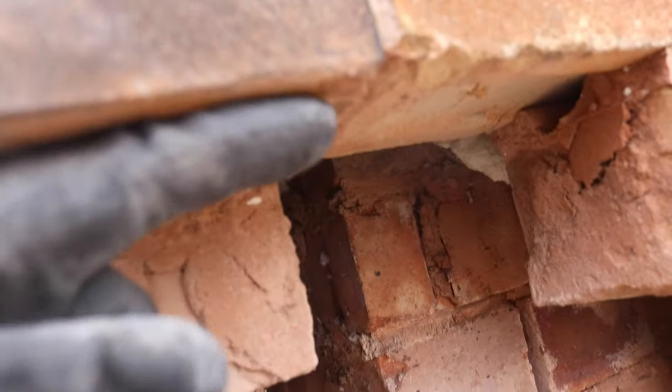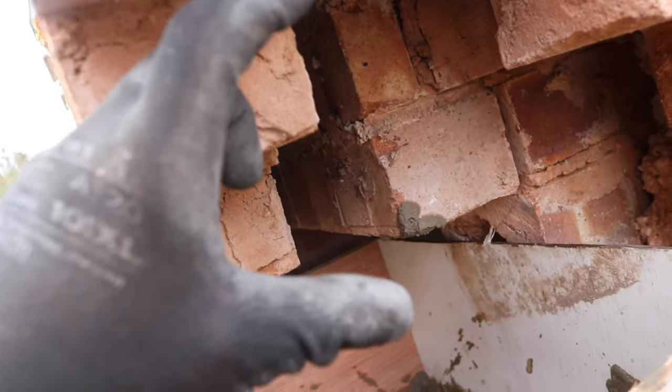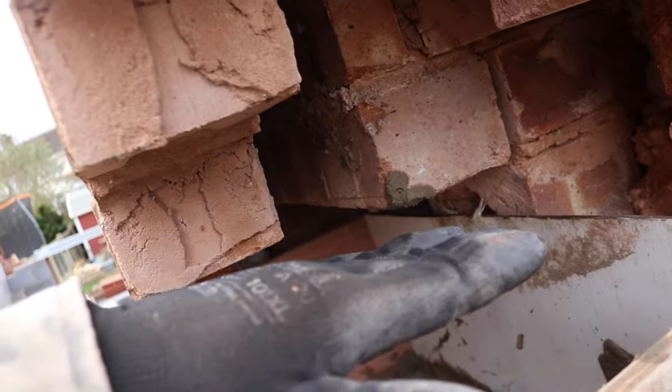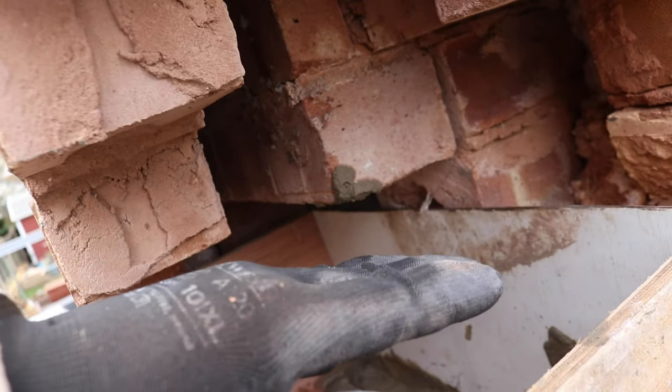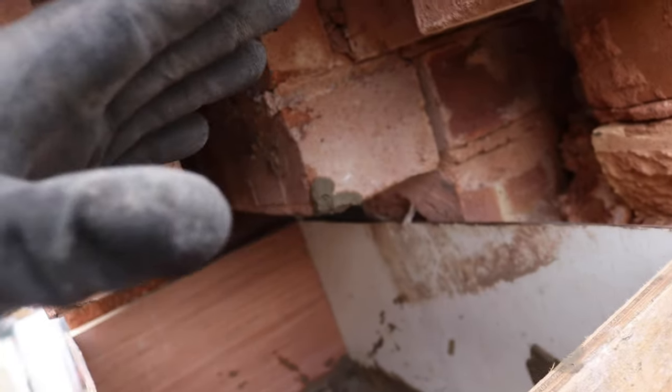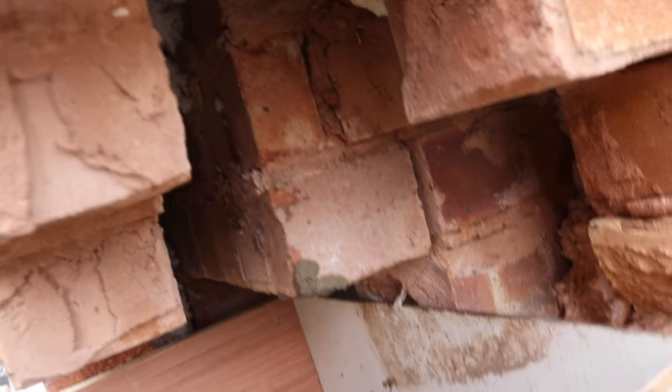Making sure we've got enough room to get our steel under here — we need 205mm to the bed of this — so I'm going to give it about 10mm of play, maybe a bit more, so we can get the steel in and pack it up as needed without trying to force it into a tight slot.